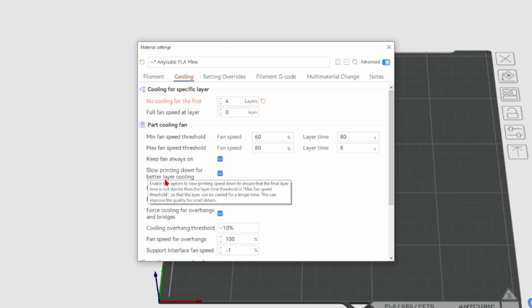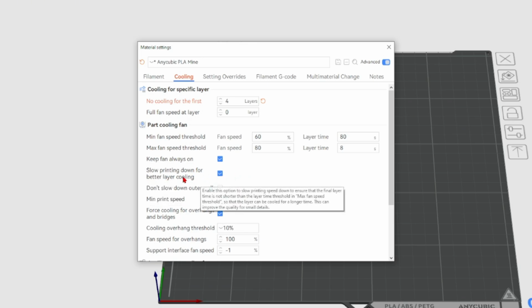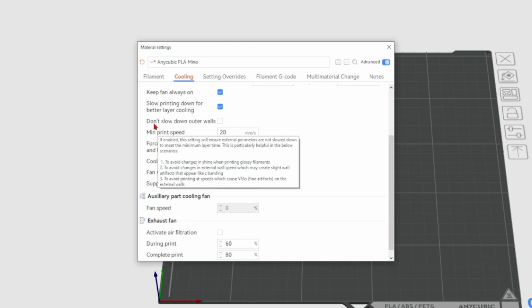Slow printing down for better layer cooling. Yeah, this is crucial. So you're gonna slow down your print for more cooling, so that it cools down your filament so that it bonds well with the other layers. And here, don't slow down outer wall. So I made many videos on this. If you want to check it out, it's on my channel.